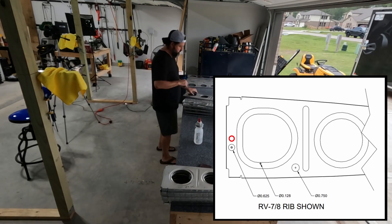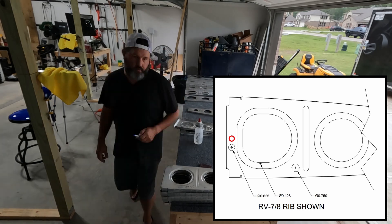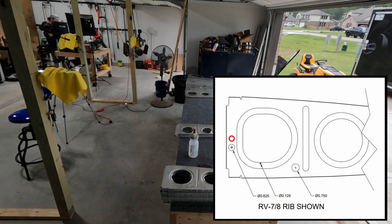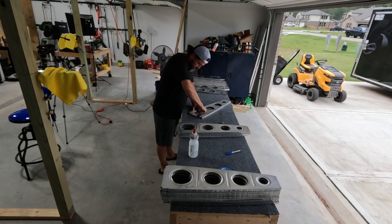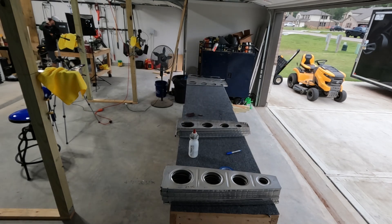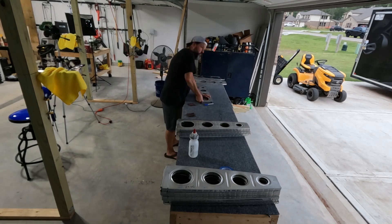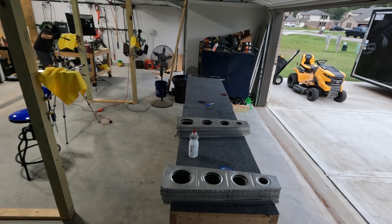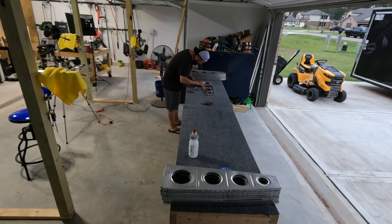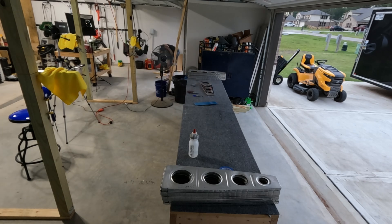There it is right there. I'm doing the lower hole, and then after that I move on to a three-quarter inch hole where a conduit will go through for wiring. That's what I spent about two and a half hours doing — you'll see me going back and forth to the drill press. I'm keeping my stacks of ribs organized; I've sequenced them for each wing from port and starboard, beginning with the inboard portion as rib one and numbering out to the outboard portion, which is number 14.